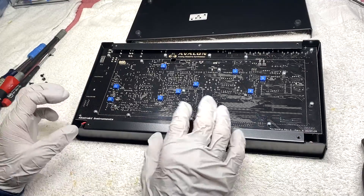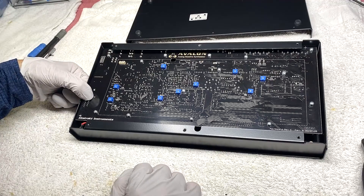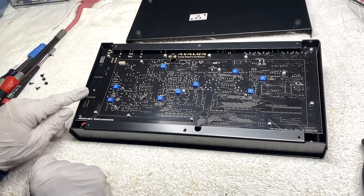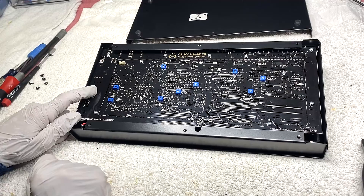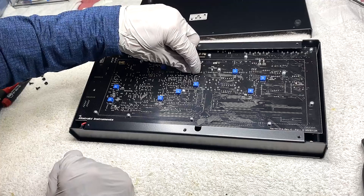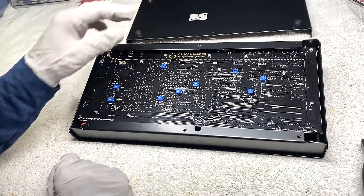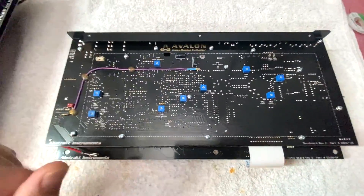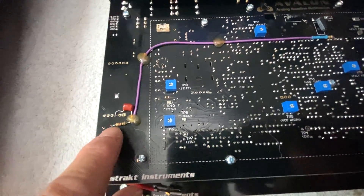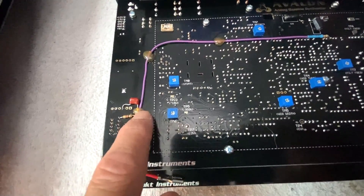For this option, I'm going to show a video where I added a 1k resistor from the filter PWM output of the microcontroller and a 220 nanofarad capacitor to ground, then a wire going to the filter input via a 100k resistor. You wouldn't even have to take this out of the case — just take the back panel off with six screws to have access. We're patching a 1k resistor to the pin.